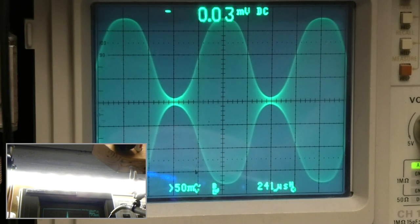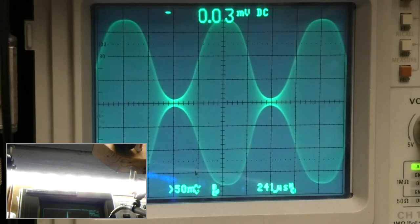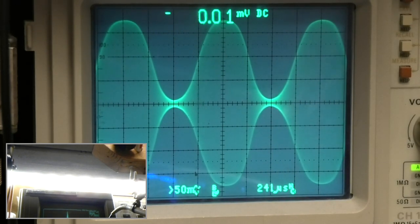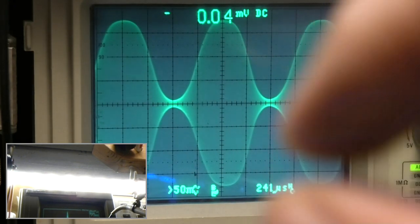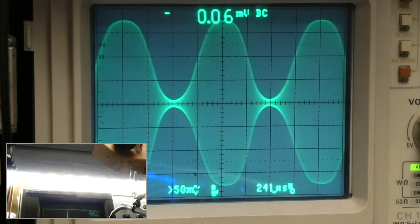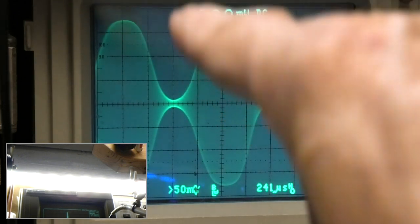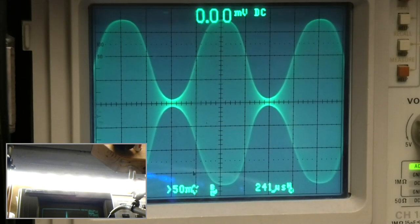What you'd be doing is turning the power down, adjusting the bias, attempting to get that to do 100% modulation with the proper ratio of positive negative peaks. But what you'd be doing is splattering like hell into the adjacent channels. I have never seen a scope go the opposite way. Never. Not yet. They're always less.